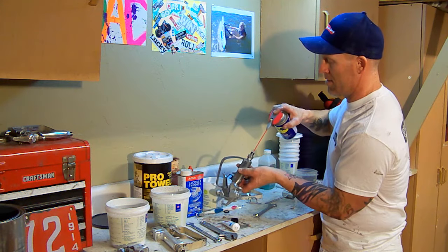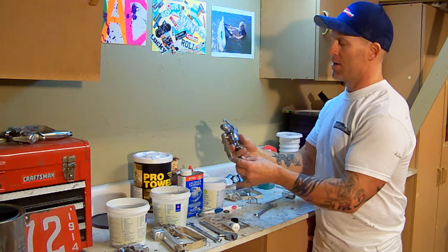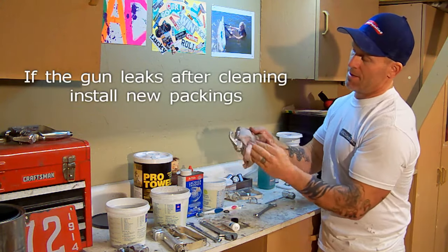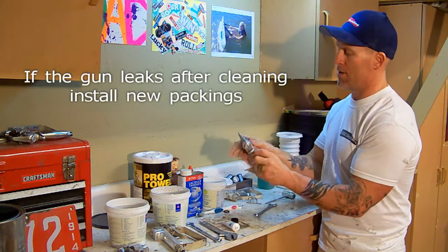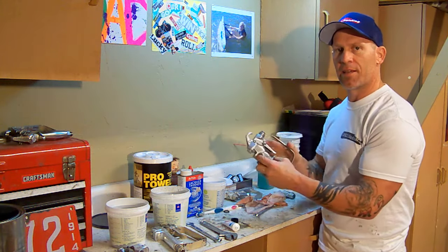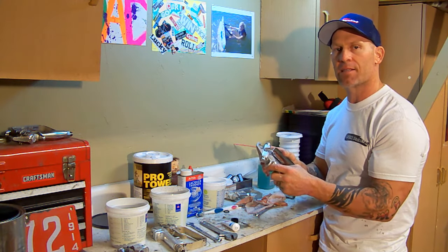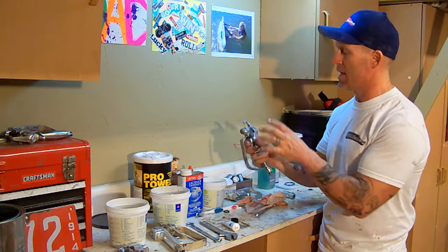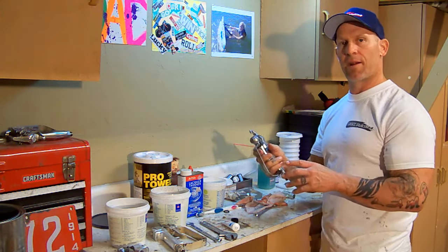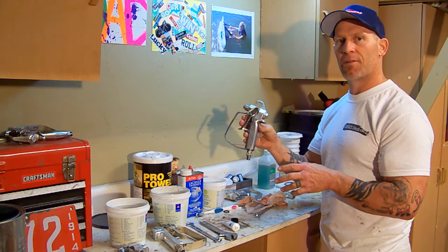I'll scrub some WD-40 down in the filter side too. Now our Contractor 2 gun is ready. I'll put it back on our pump and test it with water to make sure there are no leaks. If you get any leaks coming out of the end of the gun, the seat itself is either scored or has a nick in it, and you'll want to replace the packings — which are about $50 to $60. We like to clean it and put it back together first to see if it doesn't leak, then go from there. This is Chris in Idaho — how to clean and repack a Contractor 2 Graco gun.